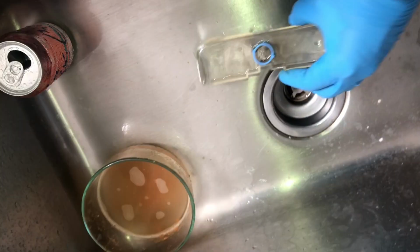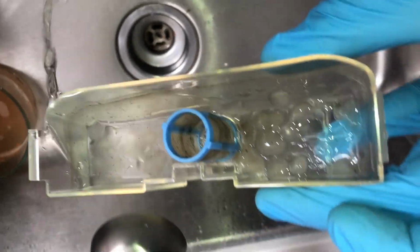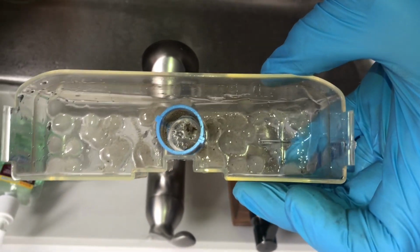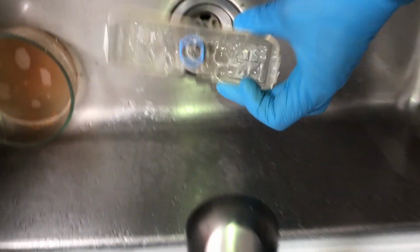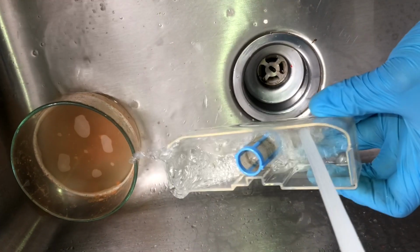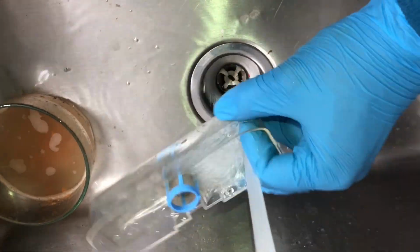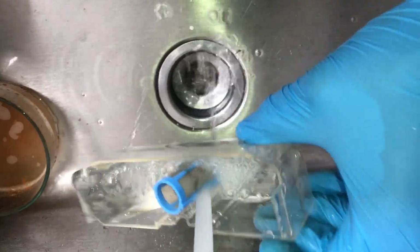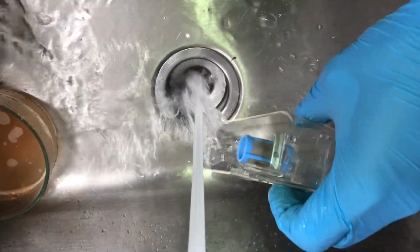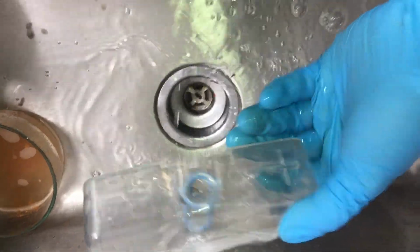On mini splits, you have this filter you gotta clean out, and it creates slime. You see a white, clear residue inside, which is called slime. That slime actually tricks the pump on the floater, making it think that it's not full. So when it does that trick, the system won't operate properly. In this case, this is what triggered and created a slight flood in this tenant's unit 202.